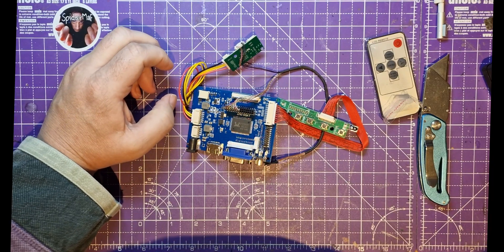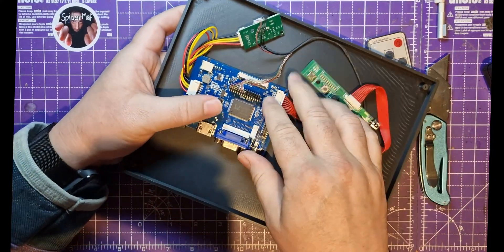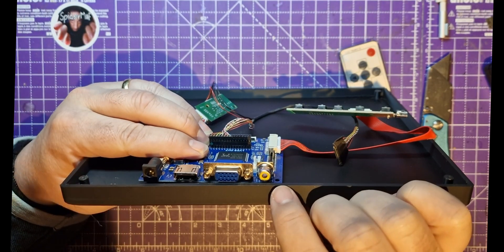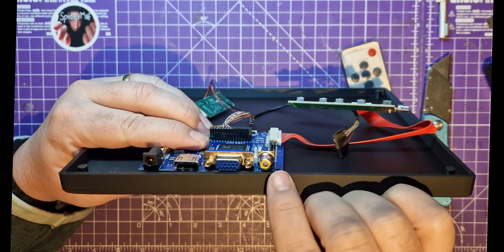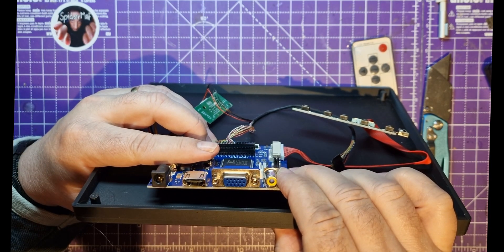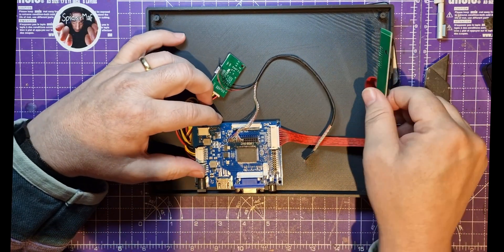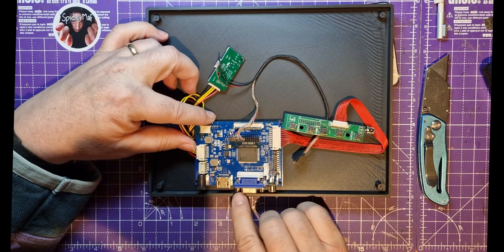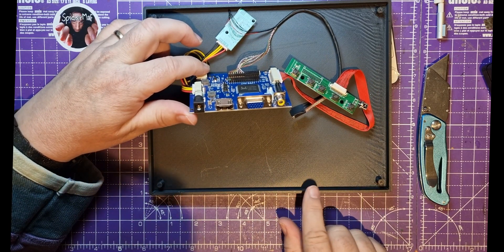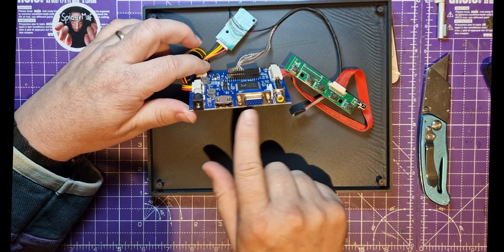Now it's working out how to fit it into the case. I've got the case and if I look at that, there's definitely not enough clearance. Looking at that, I've got to come up maybe another whole centimetre - another 10mm. For the American people watching, it's 10mm. I've never worked out fractional inches. I've got my VGA and my HDMI on the card, so I need to find a way of getting those to the outside, and then finding an I/O port model for that which I can put into my OpenSCAD. Actually looking at it, there are four holes and they could all be squares.